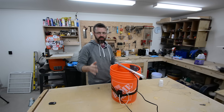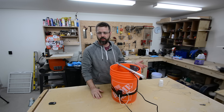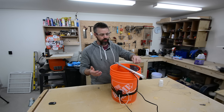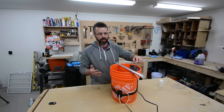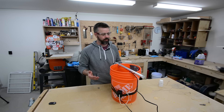So the anodizing tank itself is made up of a few different components. You've got the battery acid, which is diluted down quite a bit - one part battery acid to three parts distilled water. Then you have a cathode. I'm using a piece of lead flashing from the home center. You can use aluminum, but aluminum will deteriorate over time, where the lead will basically last forever. One note with the aluminum flashing though - there is a coating on that which has to be sanded off before you use it.